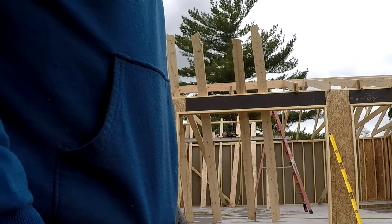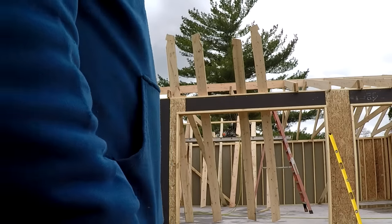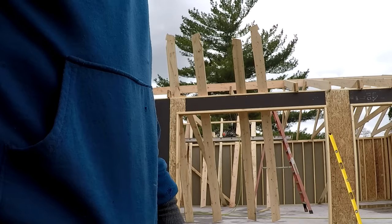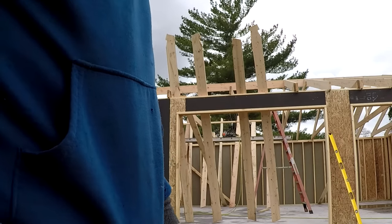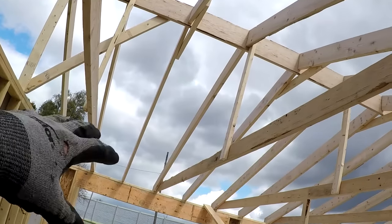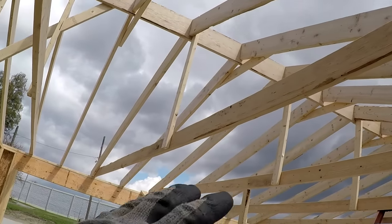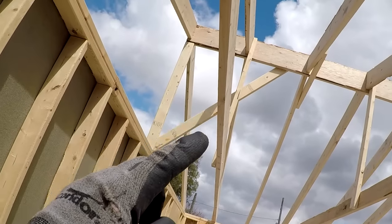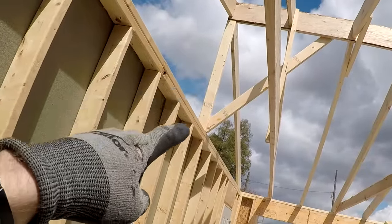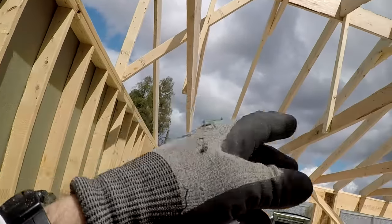It is raining and snowing and sleeting and doing God knows what else. It's getting colder, more humid. So that's all set. I should be able to move on without much peril. Everything up top is done now. So all my rafters are in. Angle brace. And I ran a ridge prop because that's on layout, so that'll be a stud and that'll be a gable stud. So I got that in, so that's all braced up.